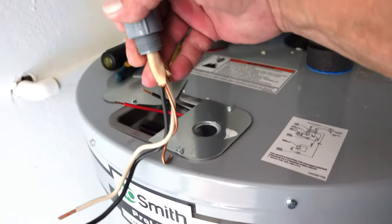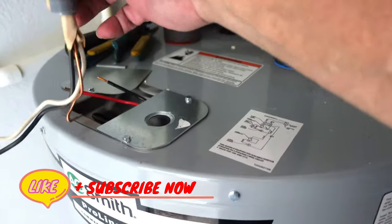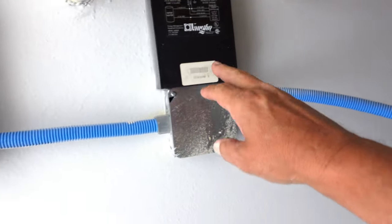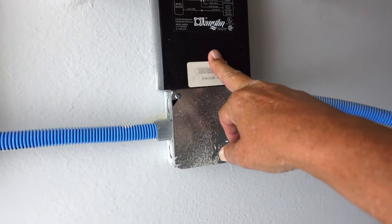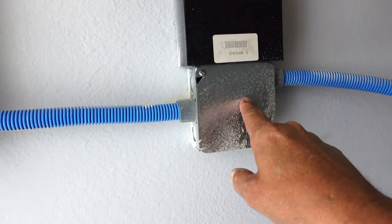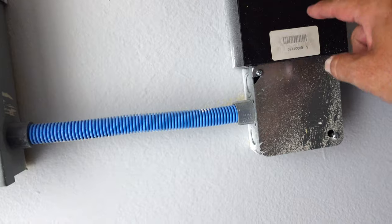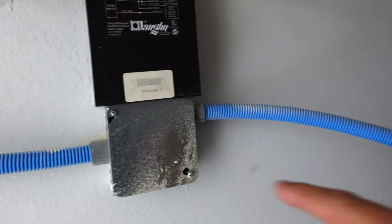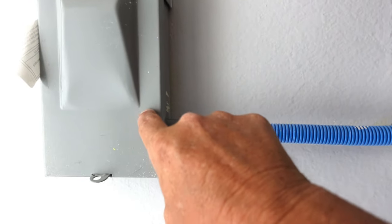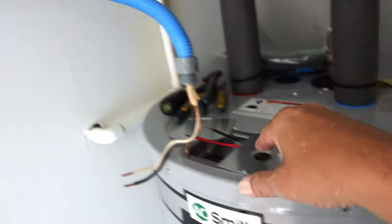This power supply is way too short for my water heater, and we've got this little energy conservation box that probably hasn't worked in 20 years. It goes in here - it comes from the power supply, makes a junction, and then supplies power over to the water heater. What I want to do is put a six-foot whip connect onto this box and bring it all the way straight to the water heater.